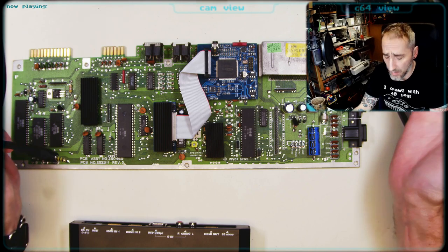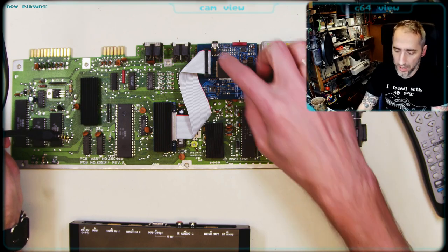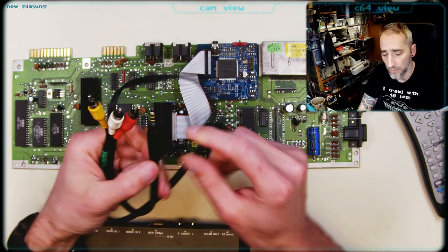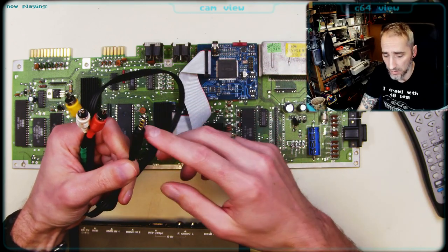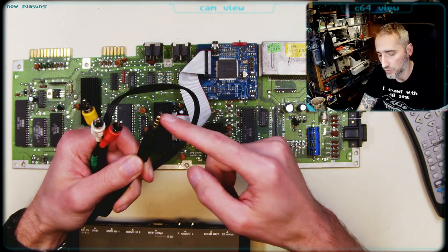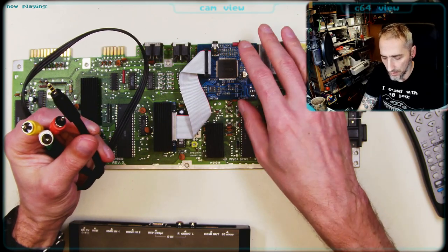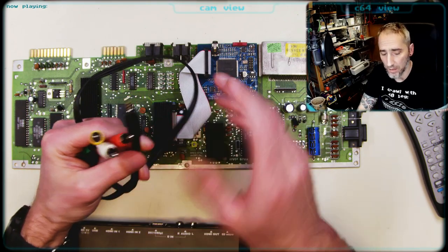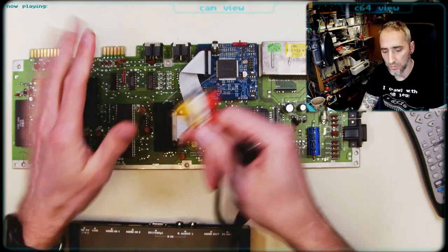Setting again. Wow, the first time I do this wrong this year. Let's count this. And here you have a 3.5 connector as well, but with four signal lines for connections. Basically it's ground and tip and two and three, whatever. The thing is that the ground connection here and the cable wasn't matching, so I really had to rewire all of those three plugs to get this connected to the OSSC.